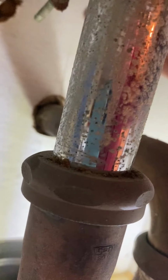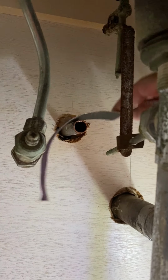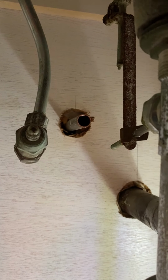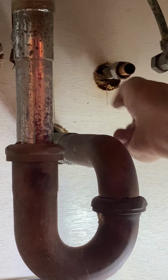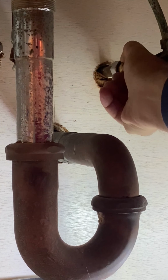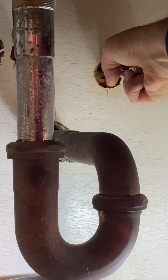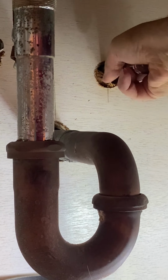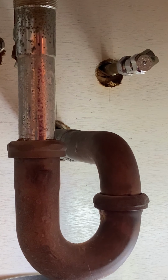And first I'm going to burnish the pipe with some emery cloth. So I've got some emery cloth. I'll just cut the roughness off the pipe and then put the valves on. Okay, now that the pipe's burnished, put the nut on, put the compression fitting in, then the valve, make sure the valve is seated, and then tighten it up. And then we'll get a wrench on it and hold it with this one and tighten it with the nut, and we'll do that for all four.